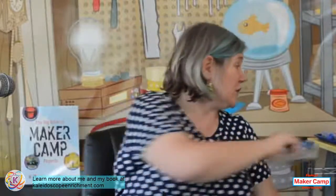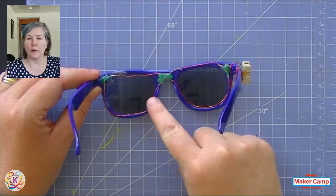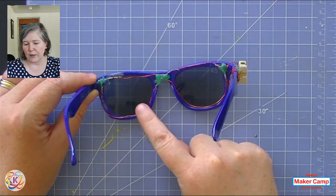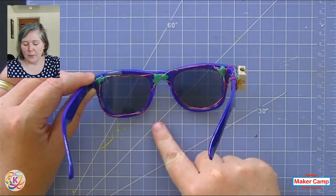We've got two ways that you can do this. The classic version from my book, okay? And again, all the step-by-step written instructions are in the book. The classic version used 3mm really tiny LEDs and, if you can see this, I'll show you on the document camera, wire. So this is a 27 gauge jewelry wire, the kind that you would use for beading and that sort of thing. You can also find copper wire in 27, 28 gauge for things like making electromagnets. And it works really well.